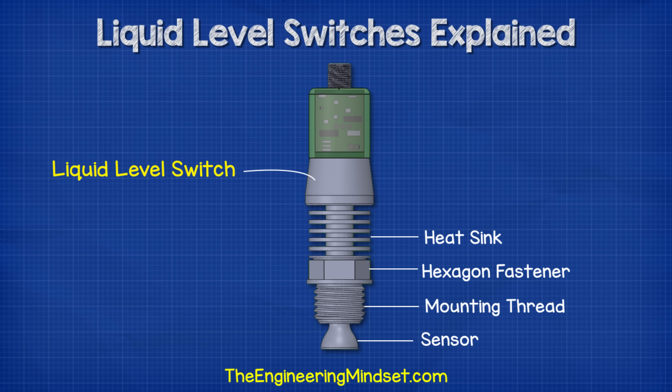Then we have a heat sink. This is just going to dissipate the unwanted heat from the electronics. We want to remove this heat to ensure the electrical components last a long time and don't overheat. These fins just increase the surface area and allow us to dissipate more heat into the ambient air. Connected to this we have the electronic circuit board which has a protective casing on. And on the top of that we have the electrical connection which allows us to power the device as well as communicate electronically between the system controller and the device.